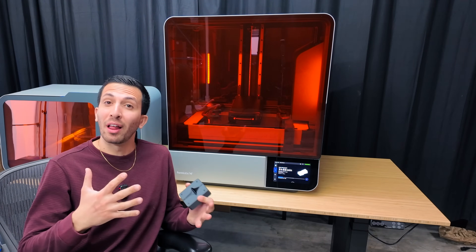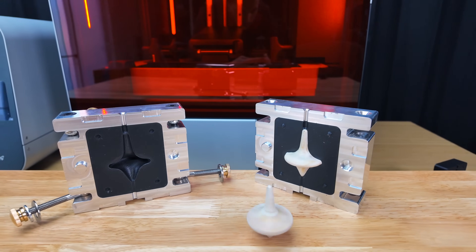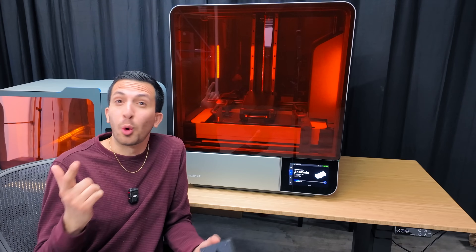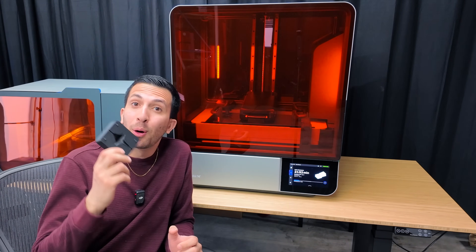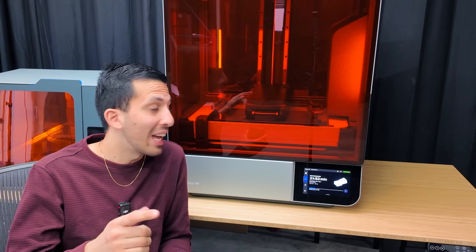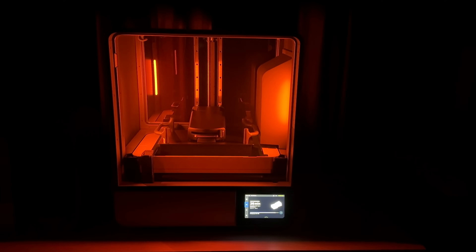So what are we making here? I've successfully demonstrated that you can use Injecto, our desktop plastic injection machine, to use FDM 3D printed molds and inject plastic into them. So is there a benefit to using a resin printer over FDM molds? The answer is we're about to find out, but realistically yes there should be. Printing one set of FDM molds takes about 12 hours; over here we were quoted three and a half hours, and I could fit about four sets of molds into a single print, meaning each mold takes less than an hour on average.